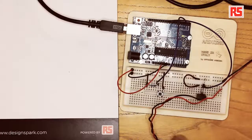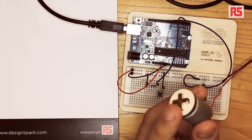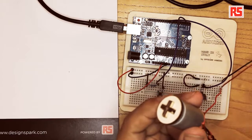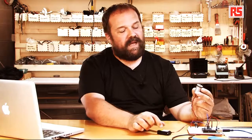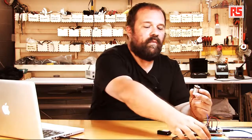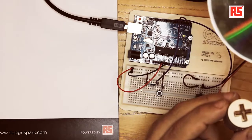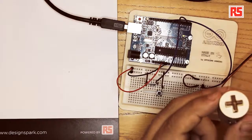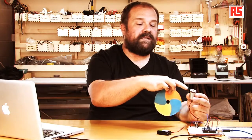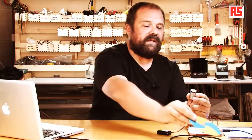To do that, we need to learn how to control a DC motor using Arduino. The DC motor is a simple electromechanical device that you see here, normally powered by a 9-volt battery. We're going to build a circuit that lets Arduino turn this motor on and off, and we'll use that to control this color wheel that we manufactured using an old CD. In the kit, you will find parts to build the wheel adapter, and a paper that you can glue on top of the CD.